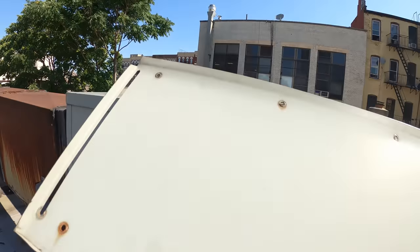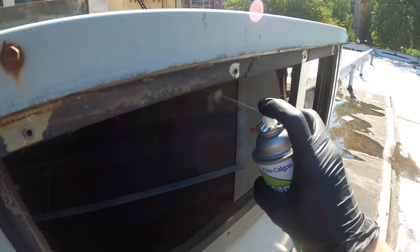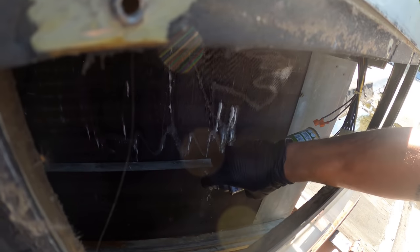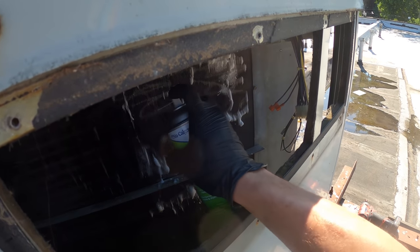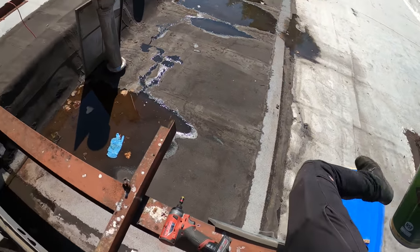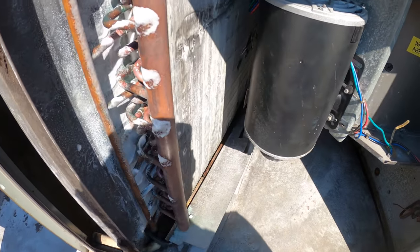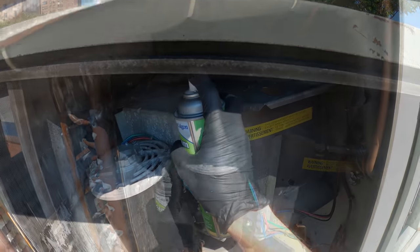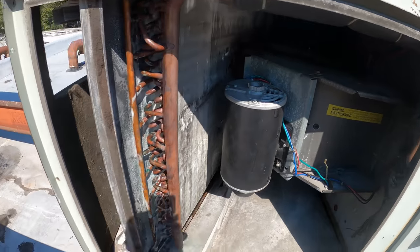While I'm letting that acid sit, let's look at the evaporator coil — we have nice little access here. Let's apply this evaporator cleaner. Wow, I already see a bit of foaming. Let's deodorize this thing and clean it up a bit. The evap kind of cleans itself while it sweats, which is probably why it's self-rinsing, but I want to give it a quick rinse as well. Oh, that is lemony fresh — smells good! There's some serious strength in this little can; I feel like Spider-Man shooting a web. We hit the whole coil.